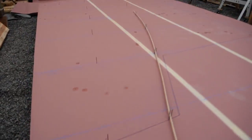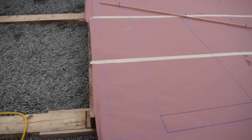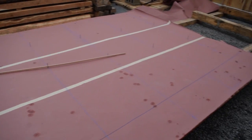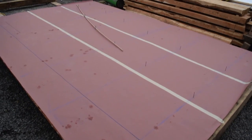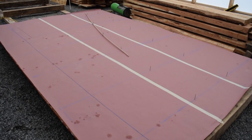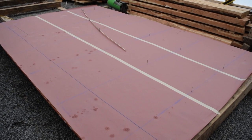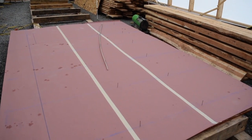All these were pulled off a mixture of the lines plan and the table of offsets to get all the measurements, which allowed me to mark each station — up to a theoretical station 41, which really isn't listed on the plans — down to station 30. The problem with working in these bow-roof sheds lined with plastic is the ventilation: it gets damp, condensation freezes, and when you warm it up with the salamander it melts and then rains inside. This spring we're going to add some ventilation to fix that.